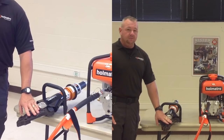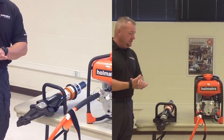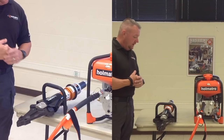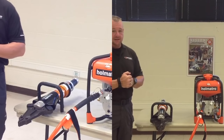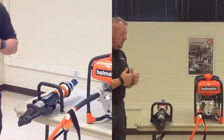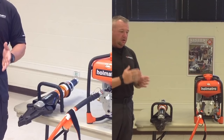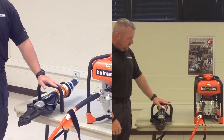The tool has about 85,000 pounds of cut force, so it will cut structural parts of the car — hinges, door latches, hood latches, burglar bars, A, B, and C posts — things we normally do extrication on. It's a straight-blade cutter, so if you've been used to using a full-size cutter or have done training with the NCT cutters your department uses, you'll notice some differences in the cutting, and that's just due to this being a straight blade. It doesn't cut round materials quite as well as a curved-blade cutter, so you'll have to learn some techniques like crushing and making things flat before you cut them, but it is a very adequate auto extrication tool.